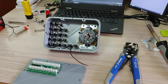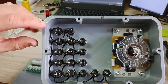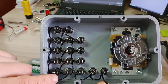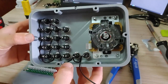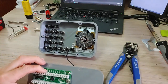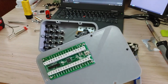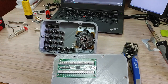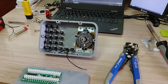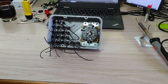All the ground wires are done. Once I worked out what I was doing it wasn't too hard, just a little bit fiddly. There's a wire starting here going down to each button on the left all the way around and back. I've checked the continuity and that's all good, and this wire here will go into one of the grounds. Next I have to work out the length all these signal wires need to be, then cut them and start soldering those on so they connect to all the buttons.